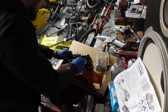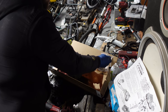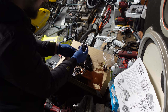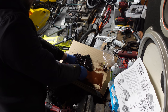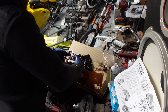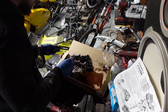These plain springs go on either side, and then we have a red spring which goes on this side. It's kind of weird how you just stack these springs up, and then a white spring goes inside on both sides. So that all goes down in there, and then on this side we have long brass spacers that go here. That one seems to be seated right. Then this goes in the third gear one, except my third gear one has this busted spring — now I've got to figure out where to acquire one of these.